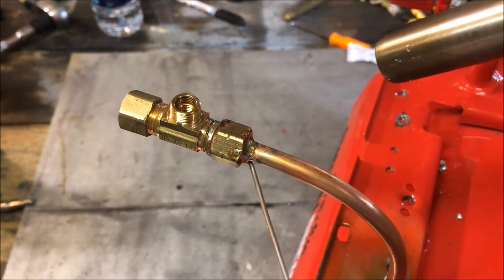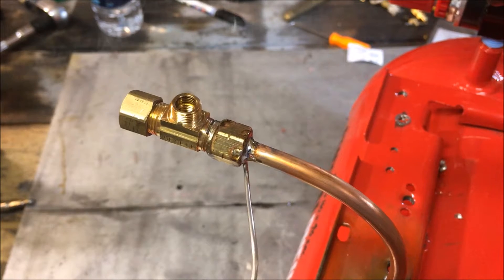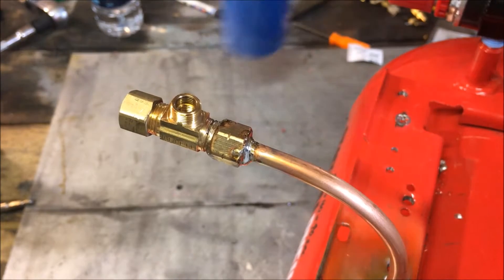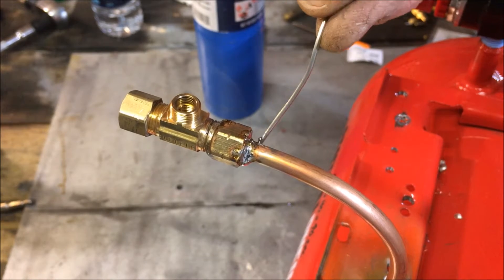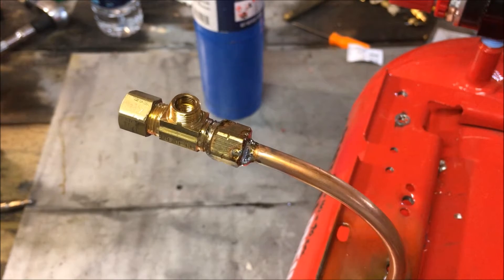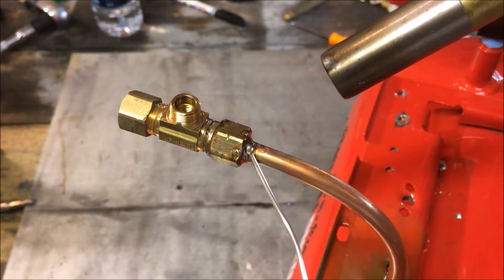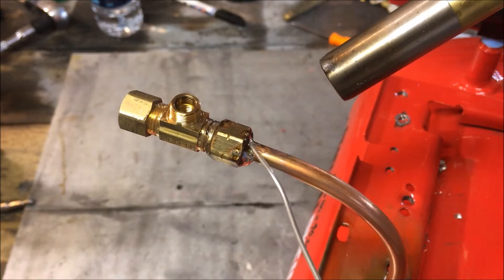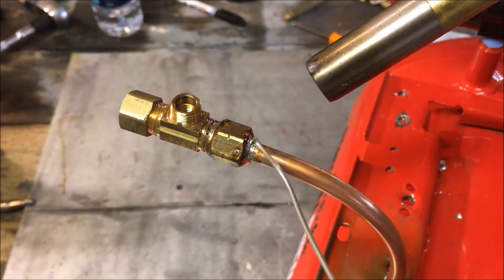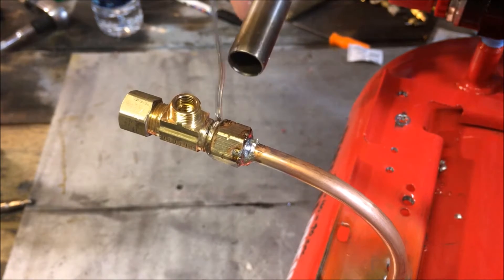This stuff's a little bit problematic here. Lead solder would have just... The reason why you see me keep stabbing it with solder is for two reasons. I'm doing something called abrading, which is actually physically scraping off any oxide layers. And secondly, we're introducing more flux into the area — that's the main purpose of that. I know it looks like I'm wasting solder, but I'm actually washing the part as we go.